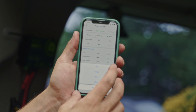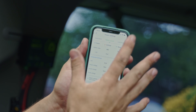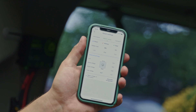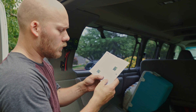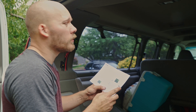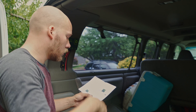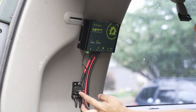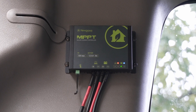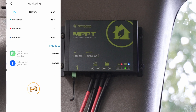Before I connect the solar panel, I want to make sure I choose the right battery type. So I'm going over here to parameter settings, battery parameter, tapping on that, and then I am picking liquid because this is just a standard lead-acid battery. It does say ensure that the solar module does not exceed or is protected from incident light — I'm not entirely sure what that means, but I think it means try and block the sunlight. So I'll throw the box that it came in on top for now, then connect the circuit breaker and pull the box off. And there we go — the red blinking light means that the charge controller is now sending amps down to our auxiliary battery.